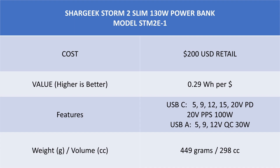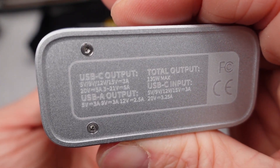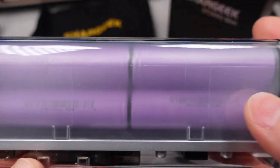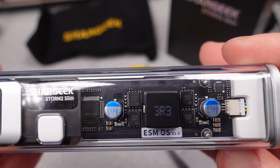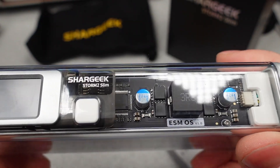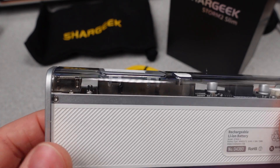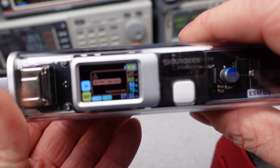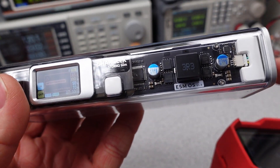The claimed charging rate of 130 watts is just way beyond what this thing can do continuously. 40 watts in or out is what it can do within a 20 degree Celsius environment. This capacity isn't anything special. The USB-C port can deliver 100 watts, but the time it can do it for is very limited — about 10 minutes. The price point is extremely high, around $200 as of 2023. It isn't cheap, but it does go on sale fairly regularly; even so, $160 for this is way too much for a clear case and poorly thermally managed product. I don't expect a lot of life out of a device with these thermal issues, but it depends on use. If you only use a 30 watt charger and only ever charge a single phone, then it will probably be fine. This power bank is well under 100 watt-hours, so it technically can travel on a plane. One thing I didn't see is a US or Canada safety listing — it does have a CE and a PSE, but no country.